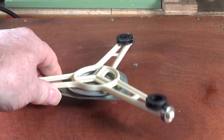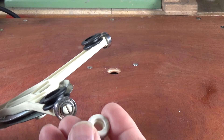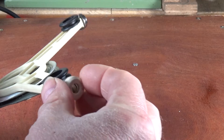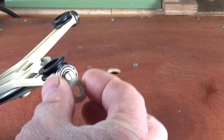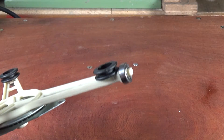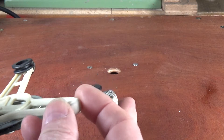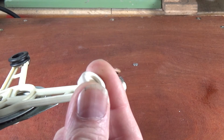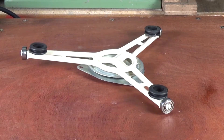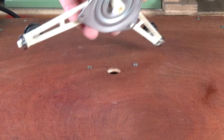The other mod I did was on the ends of the spider. Originally there were these little tiny plastic wheels that just clipped on. I've replaced them with exactly the same size ball race bearings — they're cheap as chips, cost a few pounds off eBay. These really are cheap, and obviously this thing runs a lot better than the little tiny plastic wheels and will take a lot more weight. So that basically sits in there and engages with the actual motor.